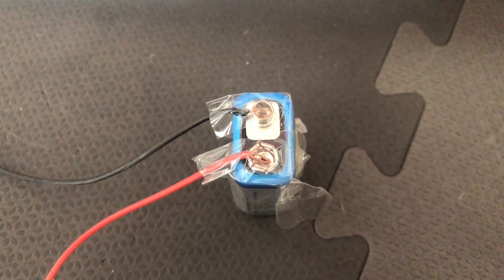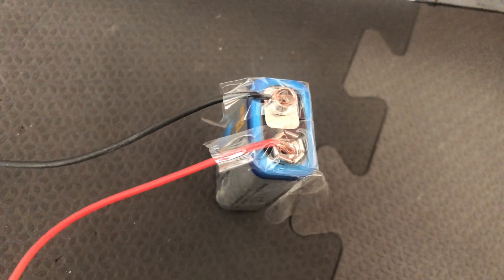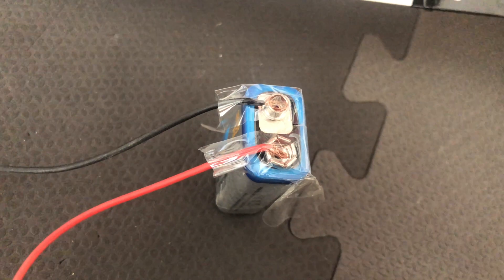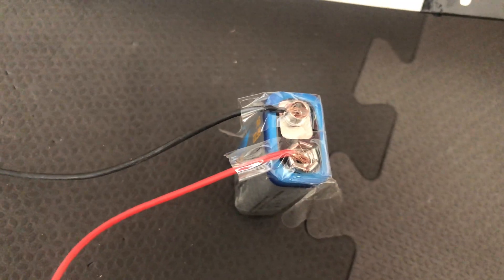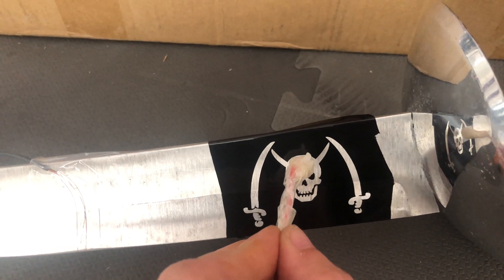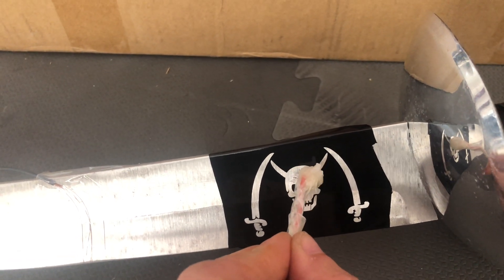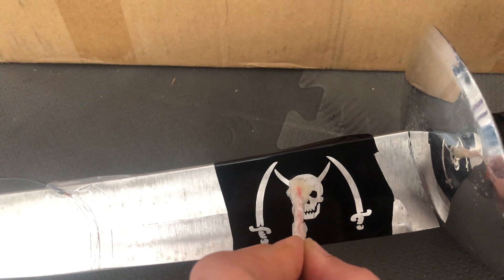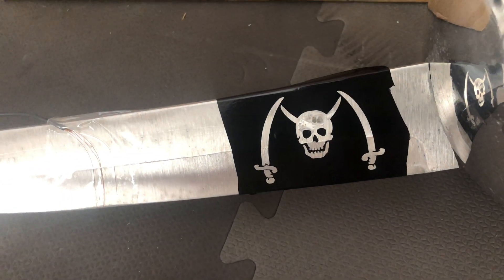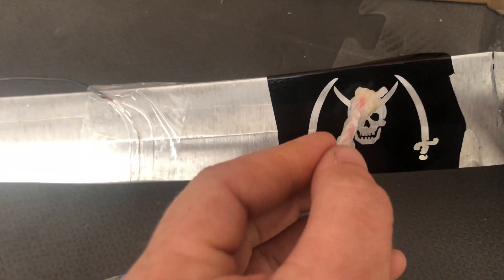You want to put the positive wire directly to the item you're going to etch, and the negative wire to the lead with the sponge that picks up the acid. I dipped it in the solution and, as you can see, the metal begins to discolor — right where I hit the forehead, the metal starts to discolor, and that is the etching happening.